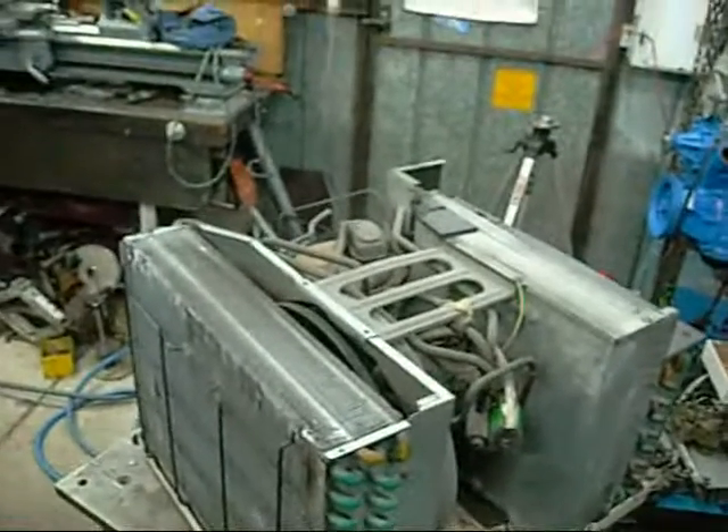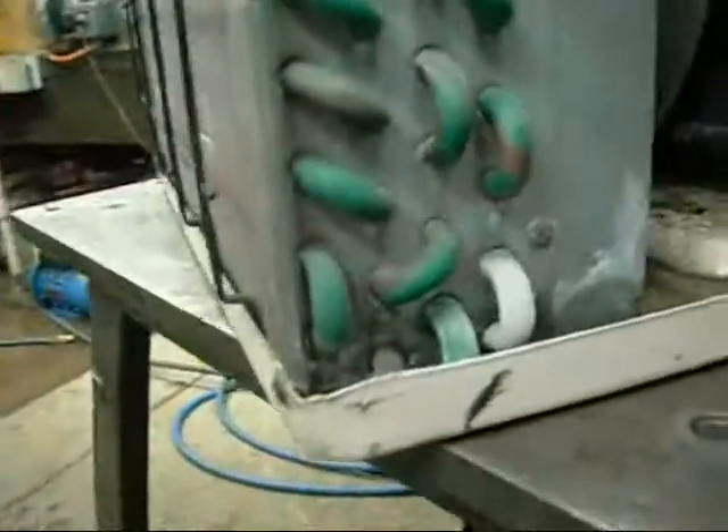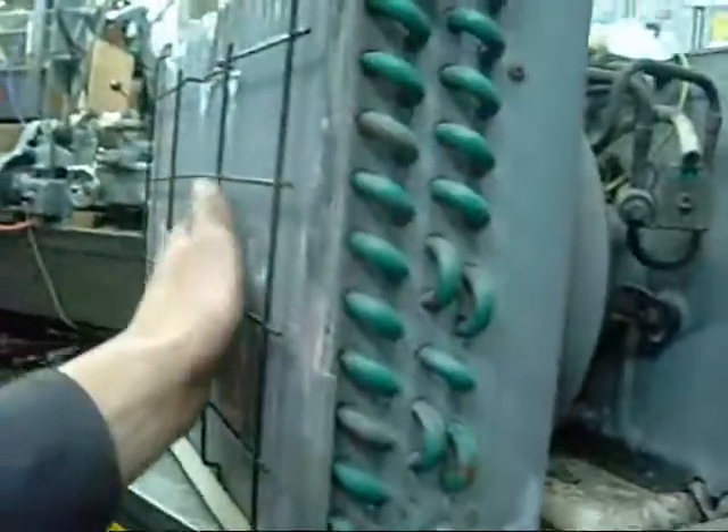Other than that, you're looking at thermal expansion or electronic expansion valves. You're just starting to freeze up at the bottom here. It would take a while for this whole coil to freeze up. But this is now the evaporator. As I mentioned before, when you change the cycle, you're just reversing the coils - this evaporates, this condenses.